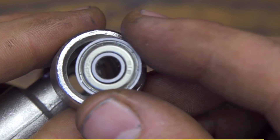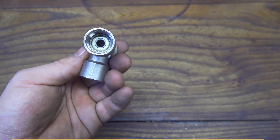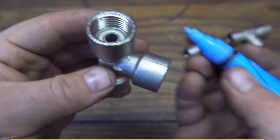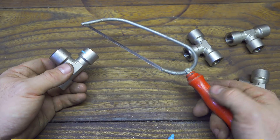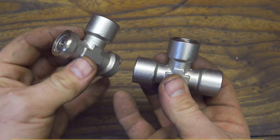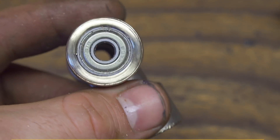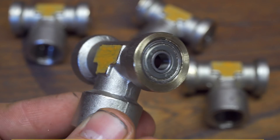We repeat the process on the other side and repeat this process 4 times, ending up with 4 female T-adapters. With a marker I mark the height of the top part of the ball bearing, cut away the excess part, and sand the component very smooth. This process isn't really necessary — it's just for keeping my slider more compact and smaller inside my bag. This finally is the result and I am very proud of how it looks — all smooth and very precise.